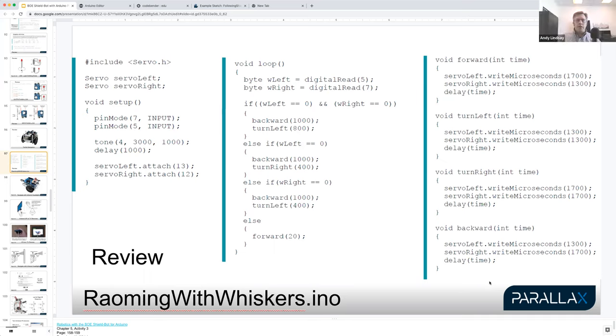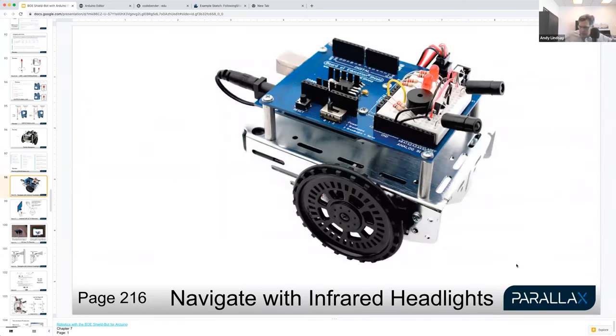Yes, we received a shipment of eighth watt resistors. These are quarter watt resistors. And so their leads are supposed to be a little bit thicker than the eighth watt resistors. The eighth watt resistors definitely were not grabbing. I have not actually had an experience with quarter watt resistors not gripping. It's not impossible, though. I have a brand new kit right here, so I will go ahead and pull out a resistor just to make sure that's what we have, since resistors with leads that are not large enough could be the problem.